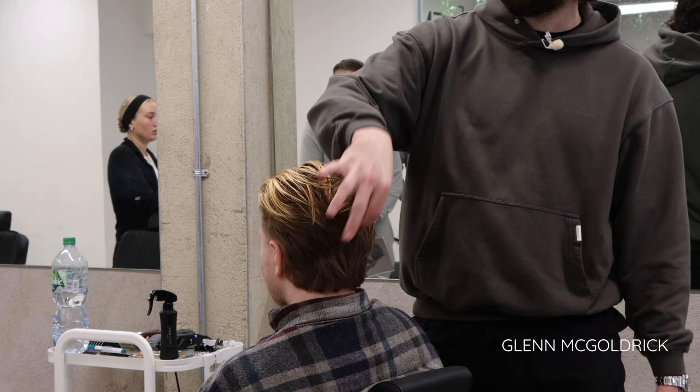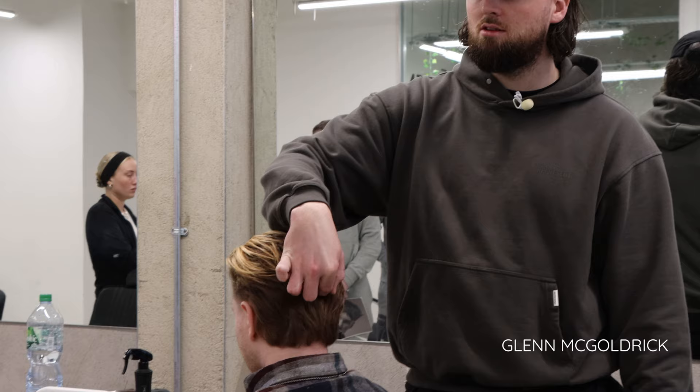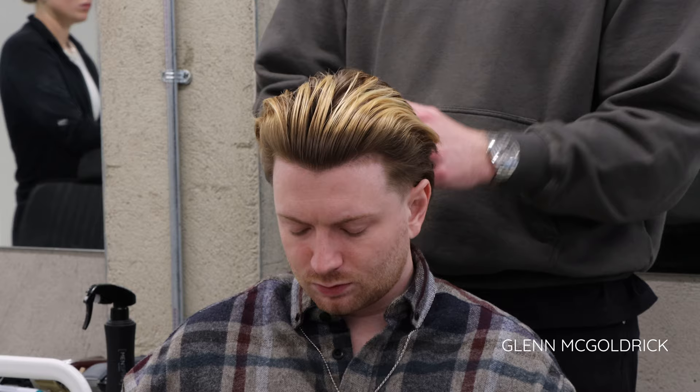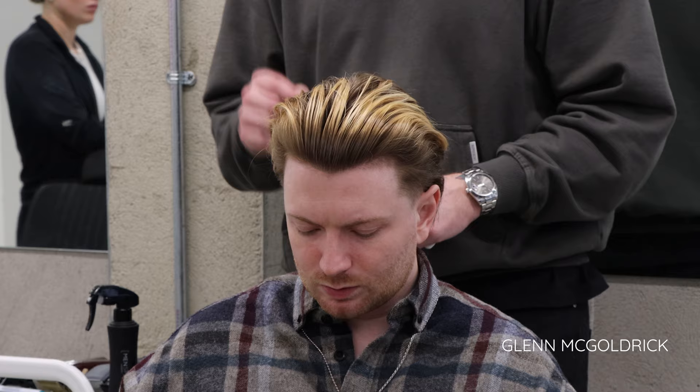The reason is that graduation starts at the back, not at the top. If I put the top first and transfer my guide to the back, but I'm not starting in the back - how am I going to get that guide there? It's impossible. Cut the back first, because that's ultimately the area I want to start on. If I've got one area that is far longer or bigger than another, I want to cut that area first, so I can use the one guide I create here to serve all of this before moving that guide to the top, which is a much smaller surface area.